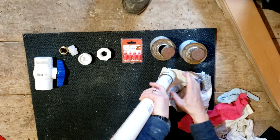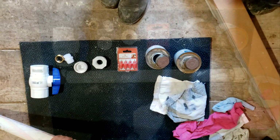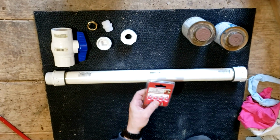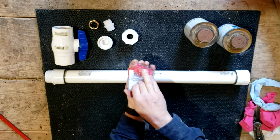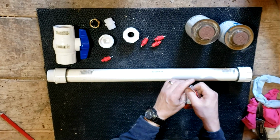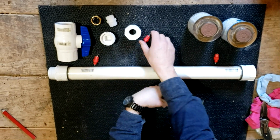At the ground faucet I'll have a valve to control regulation, and here I'll have a valve to control the water regulation. And I'll just set them barely open, each one, so there's not a lot of pressure inside, but there's water, and we'll let the birds peck away at these. As far as the nipples, they're always kind of cheap, so I always got a bunch of these laying around in case I break them. Like I said, in this case, I'm only going to use 3 of them. Kind of figure out where I want to put them here.